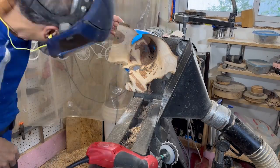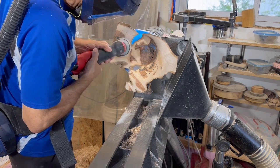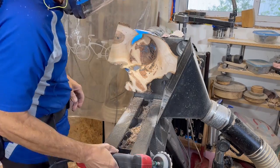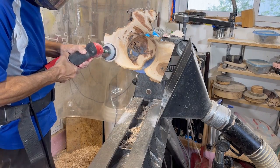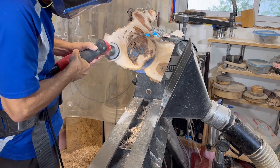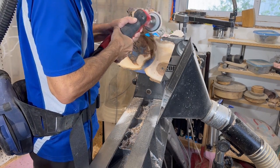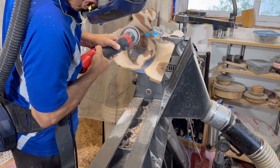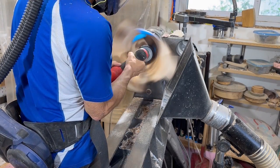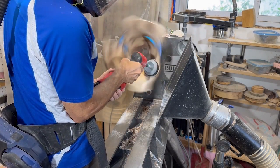Sanding pieces like this is always a bit tricky. You have to lock the lathe and sand these outer periphery areas just like this. Then the circular area in the middle where it's completely circular you can turn the lathe on and do the normal type of sanding. It just takes a lot of time running through all the grits — basically from 120, and because it's epoxy I went all the way down to 600 grit.